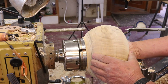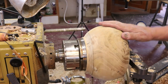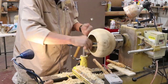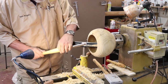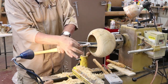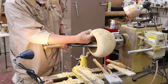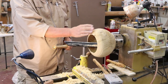I'm going to check my wall thickness and I think I'm good there. The only thing I need to decide at this point is whether I put this away and dry it or finish turn it right now. Now I'm taking a Robert Sorby scraper - I like this tool but I can't always get it into my hollow forms because it's rather wide, but for something like this it's a great tool to use. I'm just leveling off the surface in here making it a little smoother and I'll do some sanding, then decide what to do next on this vessel.